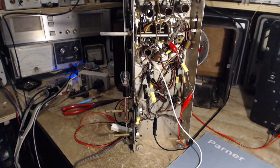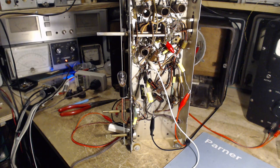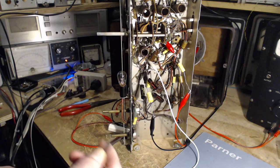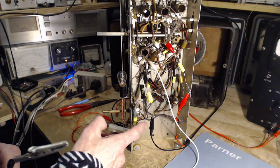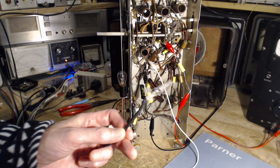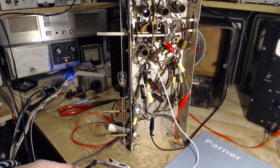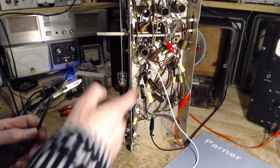Okay, and it's going to be on this meter. I have to hook up the ground for this meter. So this should really go, oh boy. What to do here? So I have one ground from a three-prong device here on the other side of this capacitor. But I really want to put this ground, which is essentially the same ground, right on the B minus. So that is sort of like moving this over to here too.